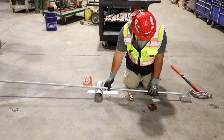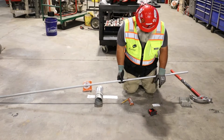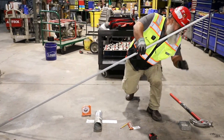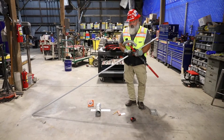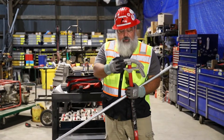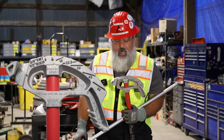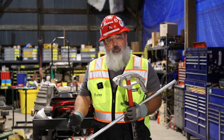If you notice, I'm three-quarters of an inch overhanging on my box now — that's going to shrink up. Our card tells us to go 10 inches and make that mark all the way around. Now, how to place our bender and what marks to use is a little different than other bends, because on our bender we have a three-point saddle mark — or the back of a 45 — an indentation on the bender itself. We've got two different indents on this bender. Our A mark is going to go on the teardrop, not the star. The teardrop is the back of the 45. Our first bend is going to be at 45 degrees; our other outside bends are going to be 22 and a half.